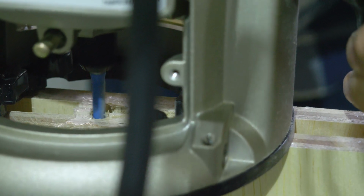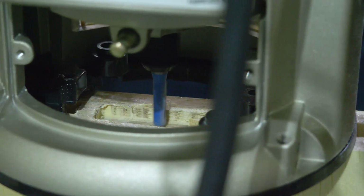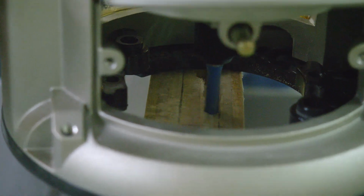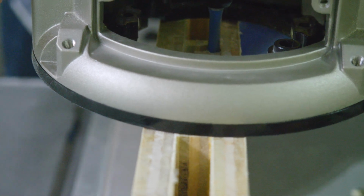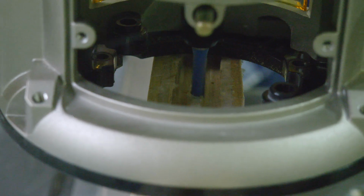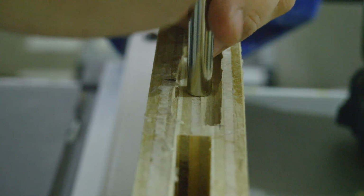So of course I wrote my lines using the wall bracket as the template. What I should have done is given myself a little bit of extra room on the top and bottom, so when I mounted it, it could move around a little bit. And then also, you have to account for the screw that's coming out of the wall that's actually holding the bracket in place. So I should have probably added just a touch more depth where the screw hits the wood.